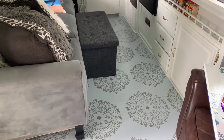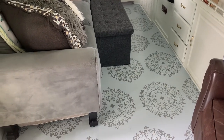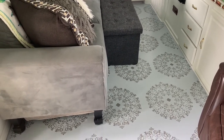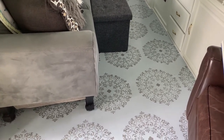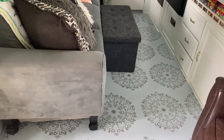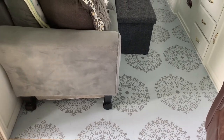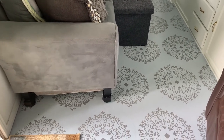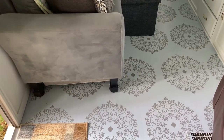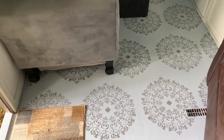When we were looking to redo the floors, we had an issue with how much it was going to cost to put down vinyl flooring and have it installed, since with my injury it wasn't something I could easily do. So we looked at a lot of different options and decided to do floor paint right over the linoleum. First we sanded it with a little orbital sander to give it a scratch coat, then cleaned the floors with soap and water and a TSP solution to get out any dust, grime, and grit. Then we put down two coats of Valspar bonding primer.